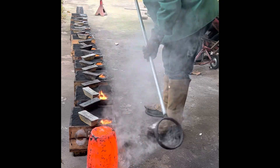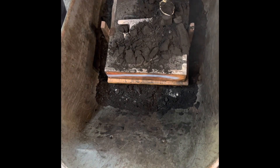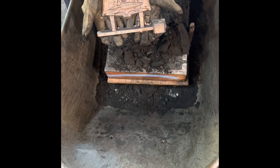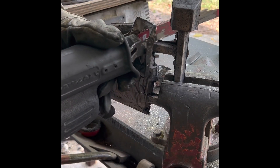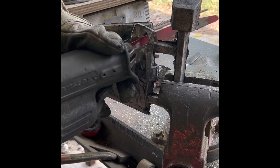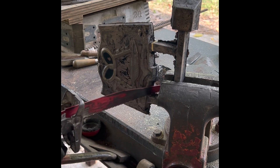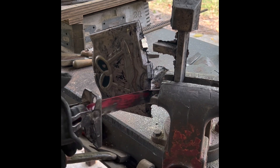And I always invert. Breakout — this is only cooled about 45 minutes, so it's still toasty. I'm a metal caster, not a videographer. Out to the vise, use a sawzall. Band saw is the best tool for this, but the blades are pricey compared to sawzall blades. An abrasive cutoff wheel works good if you can grip your off-fall casting, but it's more complicated because you can't get the circular wheel into them.